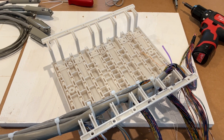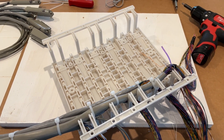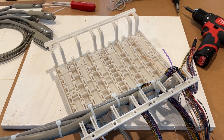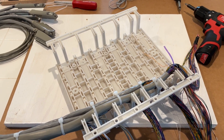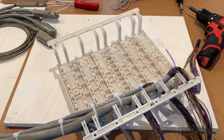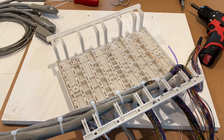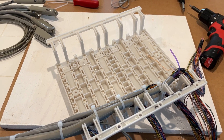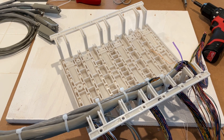We're going to refer to this as a microscopic IDF. Doing it this way allows us to select any jacks out of 120 and concentrate them down to either one 25-pair cable or 50 pair depending on the need. Otherwise, all of the cables from the switchboard would generally be cabled directly to the IDF.